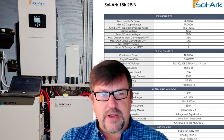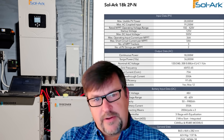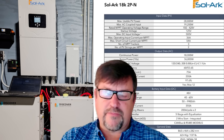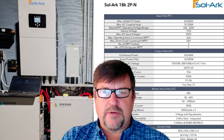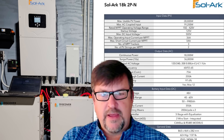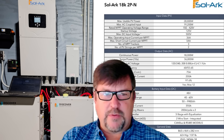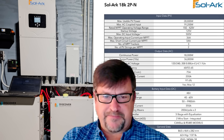This is just the latest greatest inverter in a long story, from the 3Ks all the way up to now the 18k. I'm going to take you out to my power shed and show you what I like about it, what I don't like about it, major improvements, and the unbelievable capacity. I'll also talk about some scenarios on whether or not you need microgrid interconnection devices — MIDs, as they're popularly called. My goal has been to simplify whole-home backup, and this inverter lets me do that — no critical loads panel needed, no MIDs. I can put 28,000 watts DC-coupled and 19,000 watts AC-coupled on this machine.